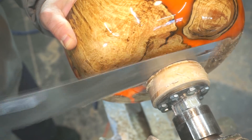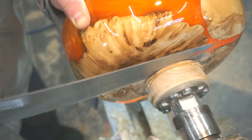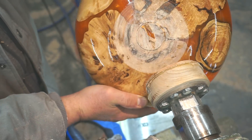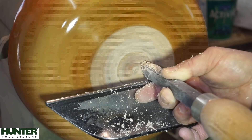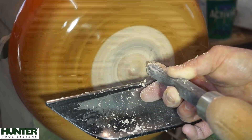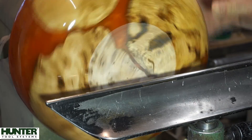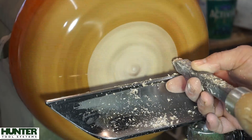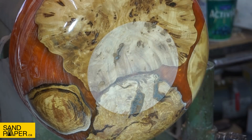After parting this piece, I typically leave about an inch. It's important not to force anything here because if you do, you can crack the resin at the bottom of the bowl — which would not be cool at this point. Just go easy with it and eventually it will give up. Here the piece is being held on the lathe with my vacuum chuck. I'm taking very light cuts, and the very center of the bowl is dished in from the outer part of the foot, so that when the bowl is sitting on the table it's not going to rock. I sanded this piece from 180 to 800 on the very bottom.